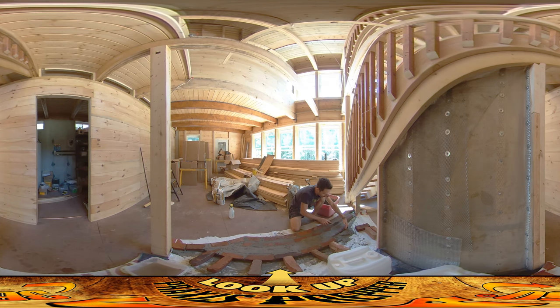All right, so I get that one in. As I'm putting them in, I'm kind of tucking them up and using the tucking motion to get concrete on the sides here. Floating that one up, and jiggling while they go in — that'll help the concrete to wiggle its way into all the little nooks and crannies. You'll get the best adhesion that way.